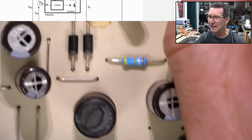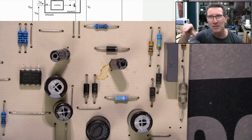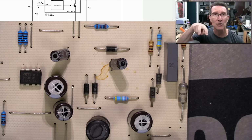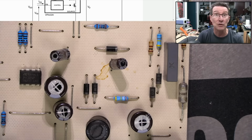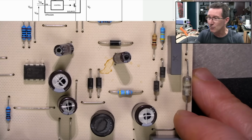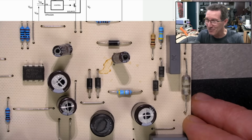But I don't see how that's related to driving this interlock mechanism, because the interlock mechanism goes ka-clunk, ka-clunk, ka-clunk, like it's slipping, the cogs are slipping in there. You can see two interlock micro switches on the top, and that whole arm with the Teflon thing there, it rotates. And you can't force it. It's really a lot of force on this thing. I did actually get it to rotate the once, and now the oven's permanently locked. Now the door's locked. It was open before, now it's locked.